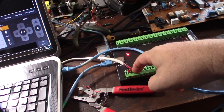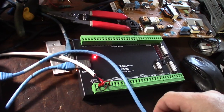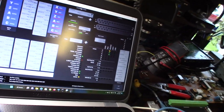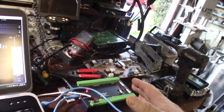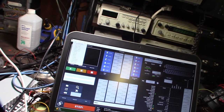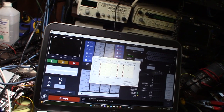The IO ports aren't getting power - you either have to run a second power supply or bridge it. I've run wires to get power to the input circuits but I'm still getting E-stop triggered. I got the thing to work on my bench. Still figuring out ports and pins on input signals - I just had to click 'emulated' for the home switches and E-stop to get into a working mode.